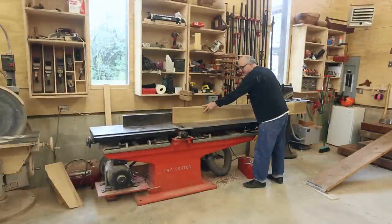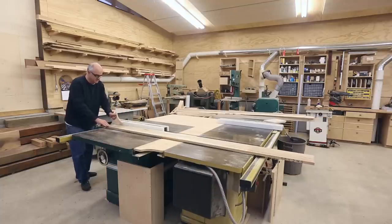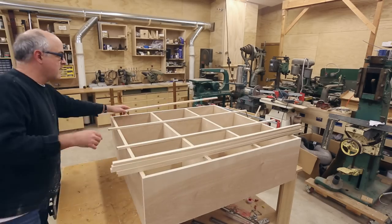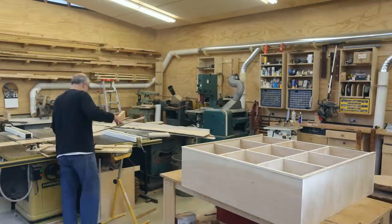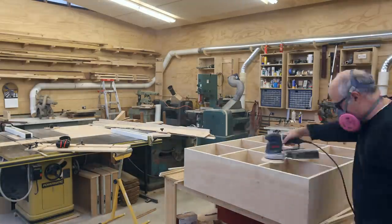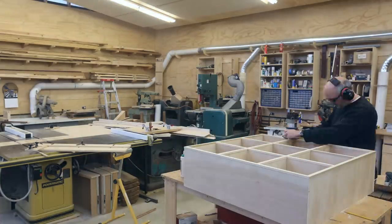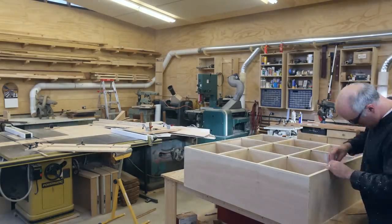Now we'll work on the trim pieces that go on the front of the plywood shelves — it's a little bit like poor man's edge banding, just cutting out lots of strips. I'm going to paint this white in the end, so I'm just using poplar. I like to lay out and make sure I have everything I'm going to need. I'll miter the corners. I'll lay out and fit everything before I actually glue the pieces on. Now I'm gluing and nailing pieces on, also starting at the center and working outwards. Now I'm flush trimming all of the edges, which was a little tricky because of the skinniness of the trim and keeping the router balanced.